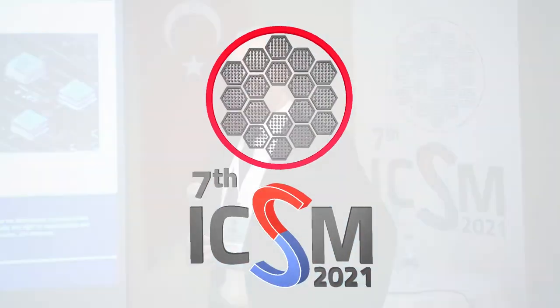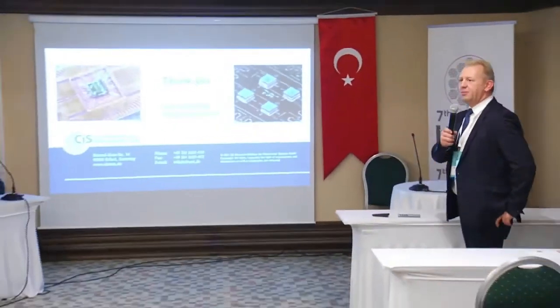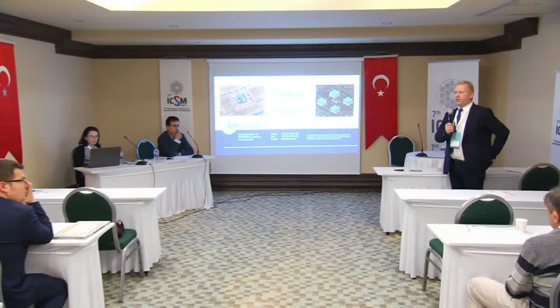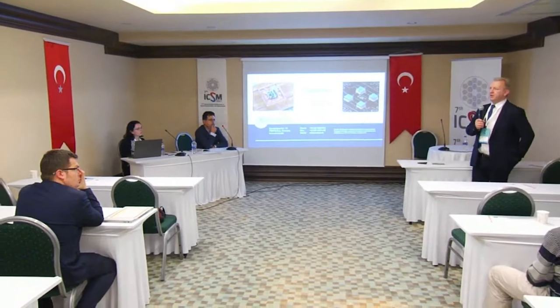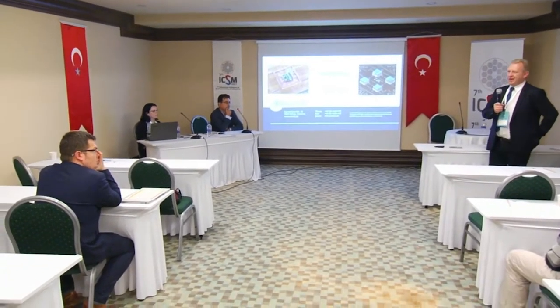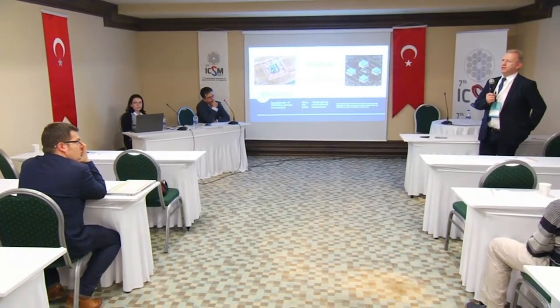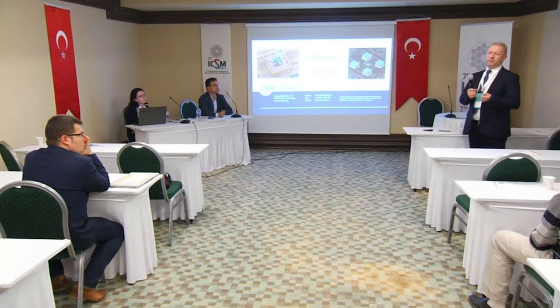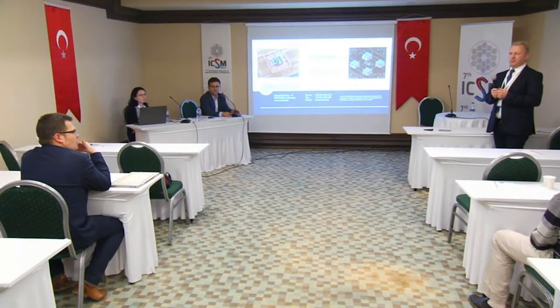Yep. What is the biggest CMOS RAM you can integrate? Okay, let me repeat the question. What is the biggest CMOS RAM we can integrate? So far, what we have done is 64 kilobit, but it's only because we never needed a bigger memory. And in the 65 nanometer node, maybe 1 megabit. The question is, can you go to a more industrial, bigger scale of RAM integration?